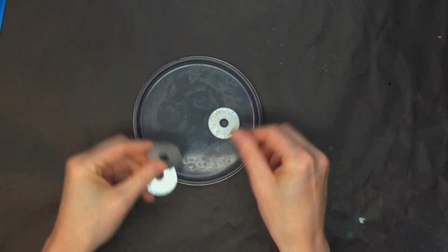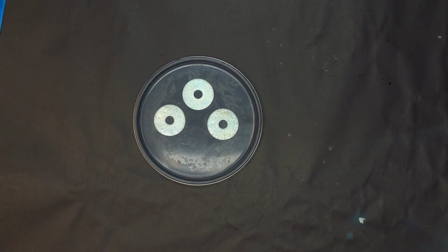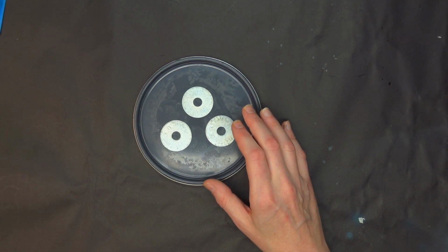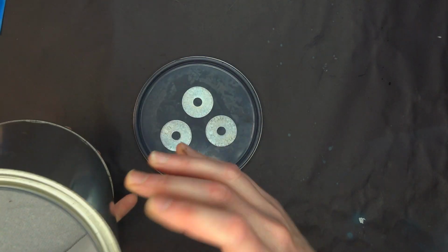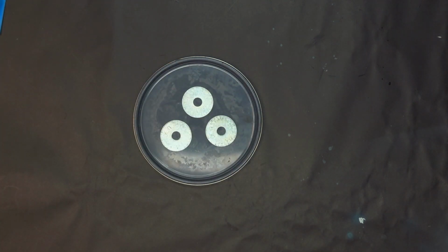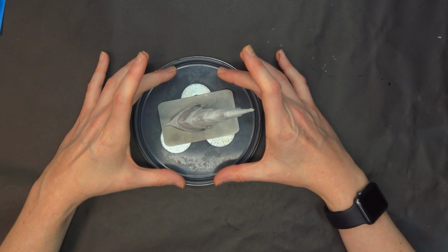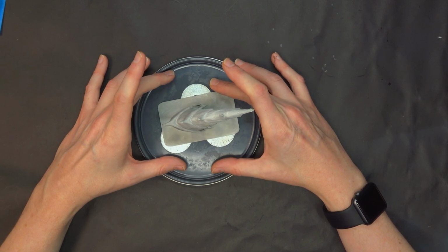Multi-purpose. Then you're going to grab some washers about the size of silver dollars. I used to have another one. I don't know where it is. We lost it, but anyways, you get the idea. So then you're just going to take your washers, very easy, and put them on the lid here. Then you're going to pour about, I think it was 1 ounce of acetone into this right here. All the paper towels and everything are going to absorb the fumes, the liquid, everything like that. By putting your part on these little washers, it's going to keep it suspended above the metal plate, so it's not touching the actual surface in case any of the liquid gets down on here.